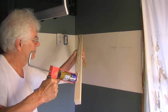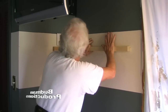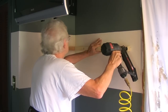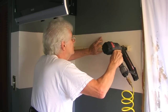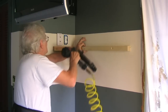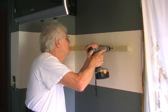Structural adhesive was applied to the back of the support, which was then positioned to align with the line — this was almost a mistake. Nails were shot in to hold it in place. I say almost a mistake because I hadn't considered the thickness of the plywood lid above the shelf support; it was tight against the receptacle plates for power and TV cabling. Fortunately it just cleared. Holes were then drilled into the wall studs through the bracket to avoid snapping off the lag screw.